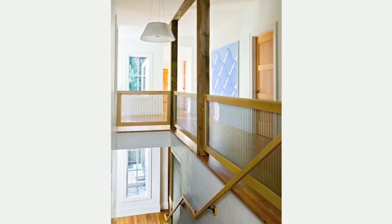Stair guards. In home interiors, the use of metal is often required to be more refined. Woven wire fabrics like the guard infill for this contemporary farmhouse comfortably bridge the divide between industrial and residential worlds. This particular material is made by GKD. Other favorite companies of mine are Banker Wire and Cambridge Architectural. Each company offers a comprehensive product line of quality woven and welded wire meshes and fabrics along with a complementary array of options. Almost everything is up for consideration in design — wire gauge, spacing, aspect ratio, attachment, base material, and of course pattern.